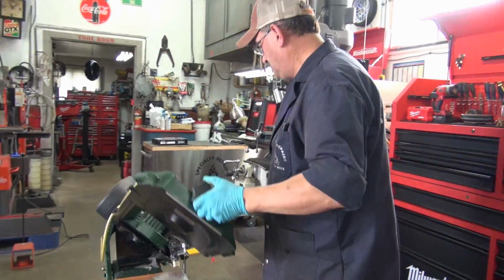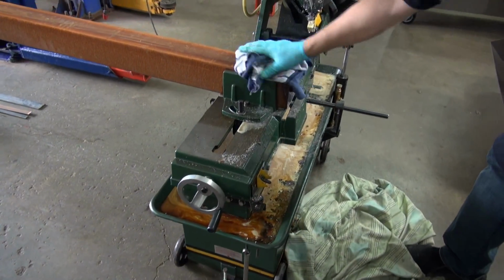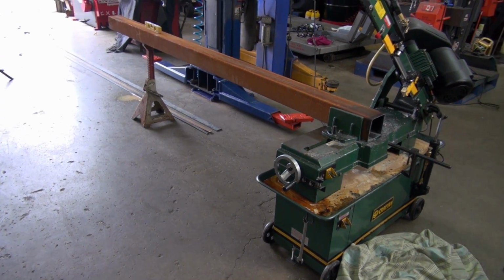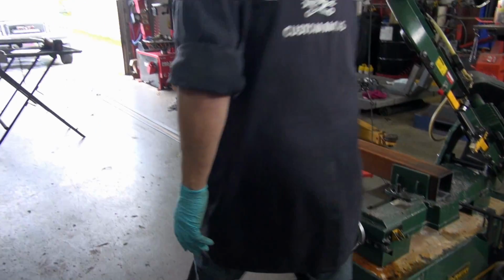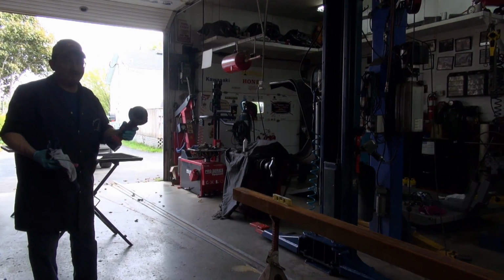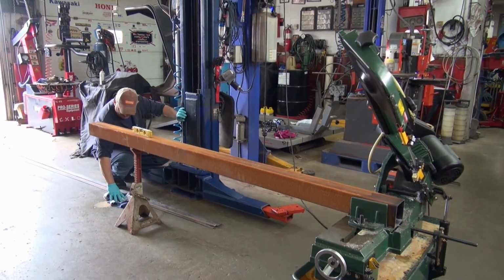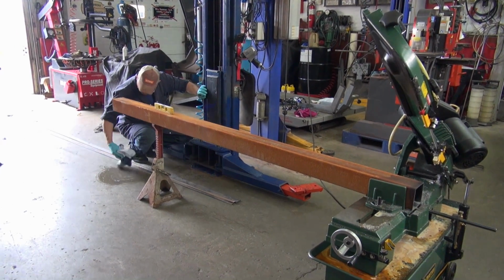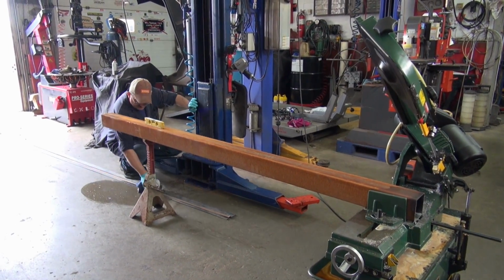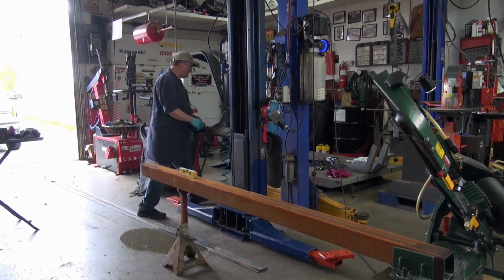What do you have to do with it now? Well, I'm going to make some small adjustments and then I'm going to put it up there, move old blue, get it out by the door. I'm going to take those pads on the grinder, those flat discs, and put a fresh one on. And I'm going to use a corded one because the battery won't last long in these things. So I'm going to put the corded one on and a new disc, and I'm going to go out and grind the rust off. Then after the rust is ground off, I'm going to determine where the threaded inserts go and drill those out and install those. Weld the plate on, then I have to get this LED light to fit.